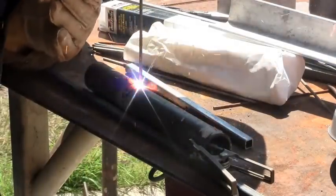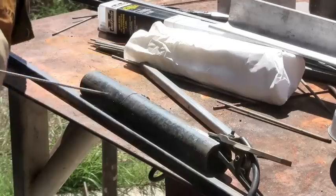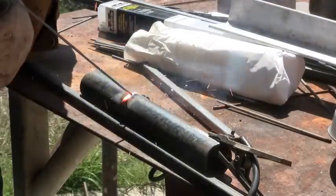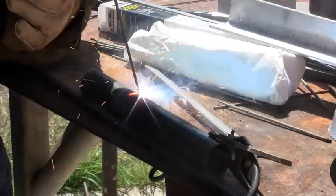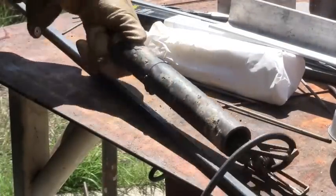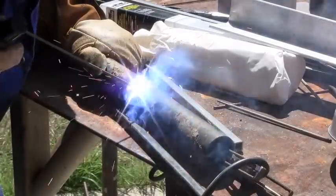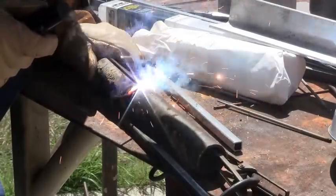What I really like are the 5/64" inch rods. It won't look that crazy when I take all that slag off, but it's not going to be a good weld. Okay, here I'm switching to the smaller rod. And as you can see, it's a lot brighter. You can hear it melting in. You can see where there's a keyhole — it's just melting the sides off, which means it's penetrating. This is my practice one. It's not terrible, not like it wouldn't work as a fence, but it's not pretty. It's pretty good for a crappy little welder.